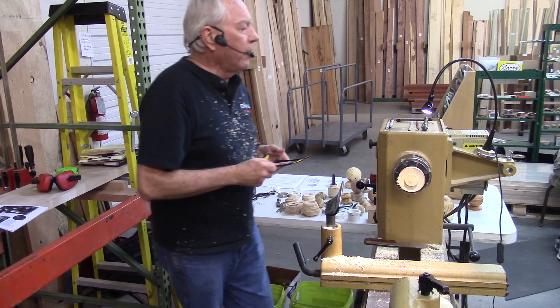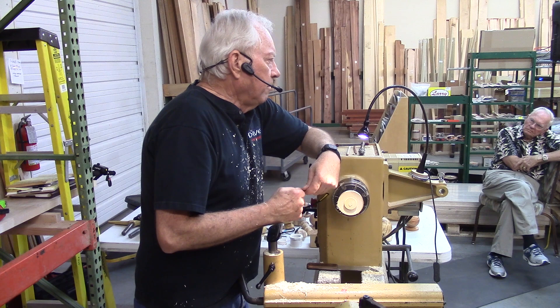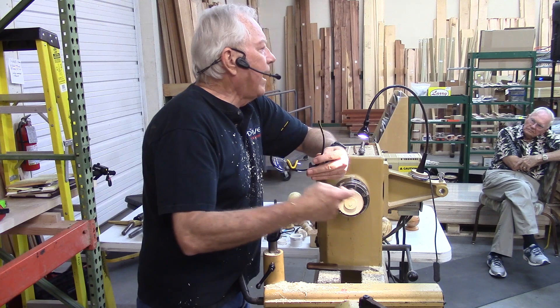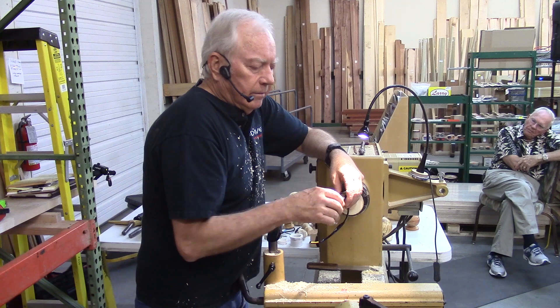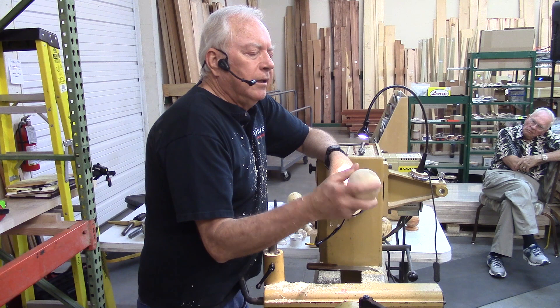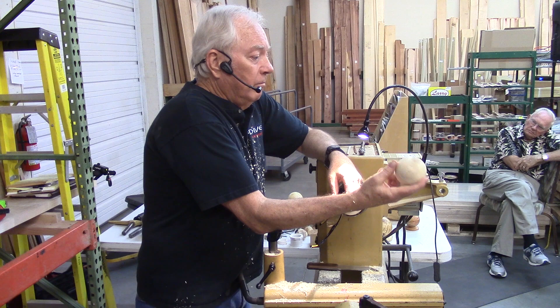Are there any questions? The more times I repeat it, the more I think I understand it, but it doesn't hurt to review what's actually happening when you take off those high spots. I've got handouts if you want them. Sorenberger's video on YouTube is very good — it shows how that tool is supposed to be used, all the same techniques. Even he, after getting to the 16th mark, goes in and starts doing just halves on the flat surfaces. Hopefully this will get you started. You should be able to do better than this for your first one. What I'm grading myself on is that it's fundamentally round — with a little more work, this will be a sphere. Thank you.